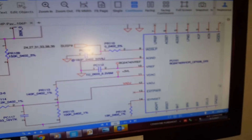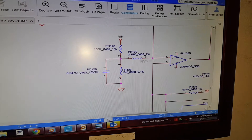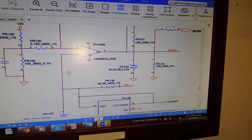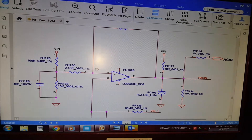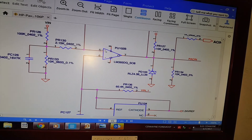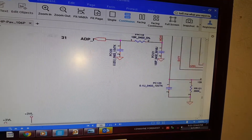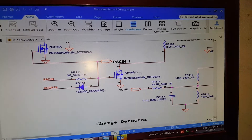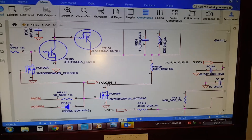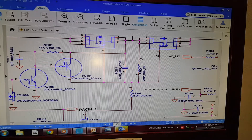From these readings we know the power AC-in signal is okay. This circuit is okay and the adapter presence is confirmed. We're going to check the comparator circuit where VIN is being compared to a 1.24V reference voltage from a diode. VIN is pulled down through a resistance to about 1.3V, and this is compared to the 1.2V inverting input. Since the non-inverting voltage is greater, PQ109A and PQ109B are conducting, pulling ground through PR105 and PR106 as a pull-down voltage divider on the 18V line.